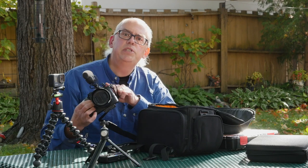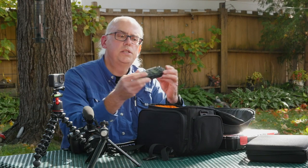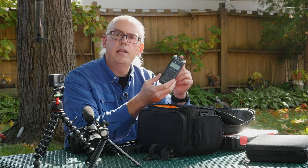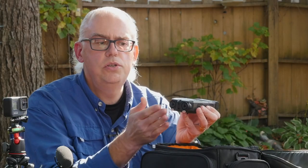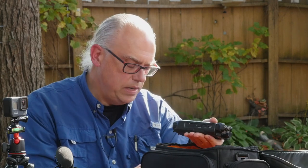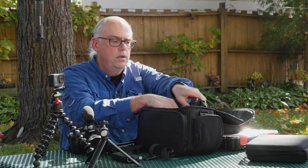Audio recorders — a lot of times I'm sending audio right into the camera. Sometimes I'll have a situation where I need to record additional or remote dialogue. If I wanted to mic another person but only have one set of wireless mics, I can use one of these small compact audio recorders — this is a Tascam DR05. I can plug my wired lav in here and slip this into a pocket, giving you an extra audio recorder to mix in. I also have a larger four-track — the Zoom H4n Pro — that I'll use for productions too. It's got XLR plugs on the back, which is super handy, along with other line and mic level inputs. A great tool for audio production.